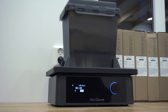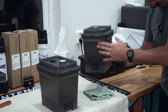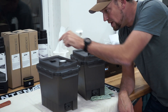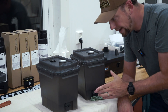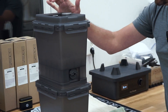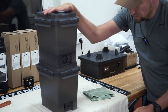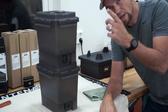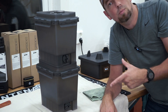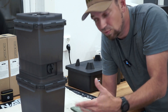And we're almost done — three, two, one. Now make sure the valve on the bottom is closed. Also make sure the air inlet valve on the top is opened, otherwise you will have an accident. Once both are set correctly, open it up and you will hear all the isopropyl alcohol draining out of the top bucket into the bottom bucket. What you end up with is just the part in the top, and the isopropyl alcohol in the bottom tub you can use for your next wash.